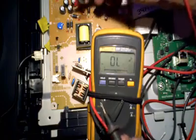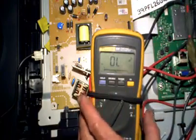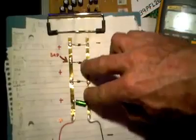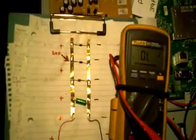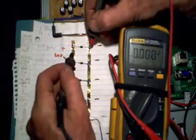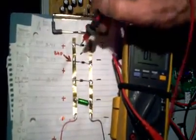Not only do all four of these diodes appear to be shorted, but also the capacitors. If you want a better explanation, think of a simple circuit: three diodes and a capacitor, and only one diode is actually shorted. Because one diode is shorted, it shorts out the whole power rail. So if I take my meter on diode check, it doesn't matter where I measure — the whole thing appears shorted, even though only one diode actually is.